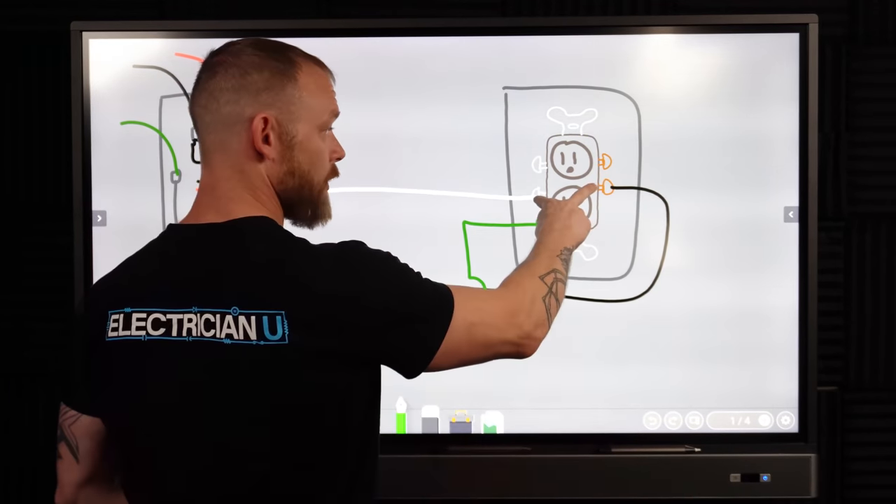I hope that helps. For advanced people who've been doing this a while, it's a pretty simple video — but just understand the neutral and the ground are completely different things. The neutral is designed to carry current and is therefore classified as a current carrying conductor — in that way it's more like an ungrounded hot than it is like a ground. Let me know what you guys think, leave some comments below, love you crazy people, and I'll see you in the next one.